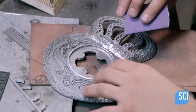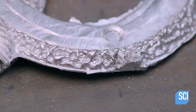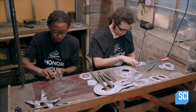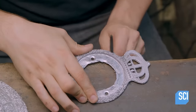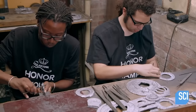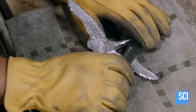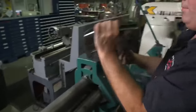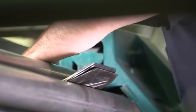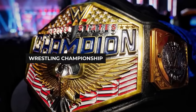The end result of this process is a perfect plate to which any remaining details can be attached — things that are impossible to bring across by casting, like sharp letters, sculptures, and other small elements. These are crafted separately from the main structure before being attached to the base. After this, they undergo the same hand refining process to match their surface to the rest of the tin. Once the belts have been crafted in this way, all that is left to do is electroplating.